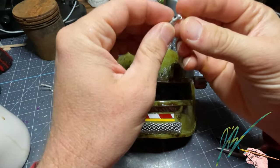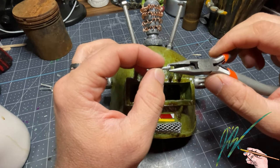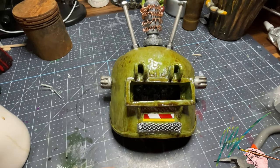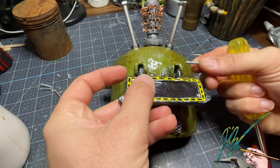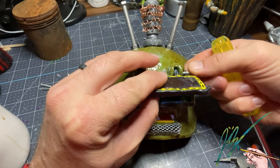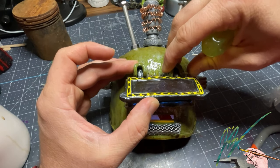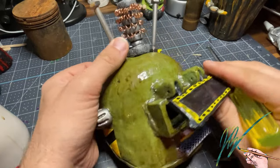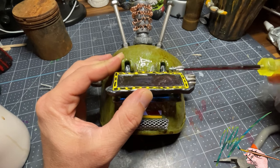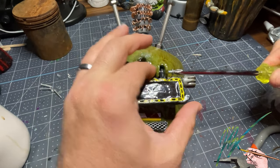So I'm just using a simple bolt with washers. There's gonna be two nuts on the interior of each bolt, and those will be tightened not to the clay but to each other. So it takes a little bit of finagling with some pliers here, and by having those two nuts tightened against each other or torqued against each other, then the bolt shank length between the head of the bolt and the first nut leaves space for the washers and the clay and the hinge of the door to move freely without me worrying about it tightening automatically or loosening on its own. So that still could possibly happen, but it's just less likely.